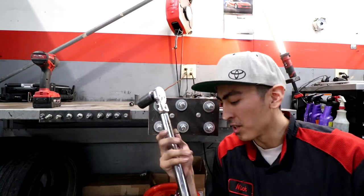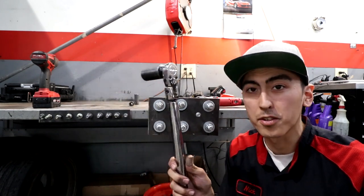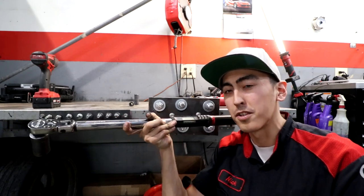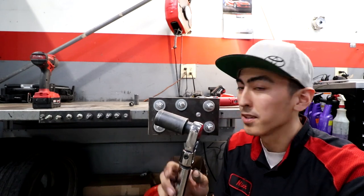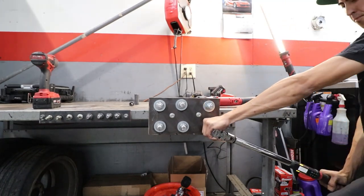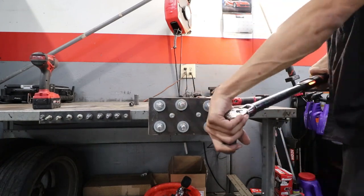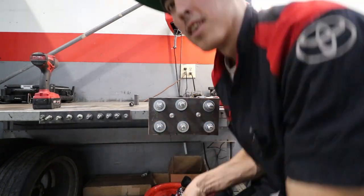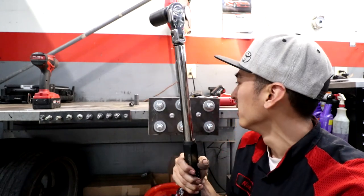All right, well, that's actually really impressive. I was able to take off 250 foot-pounds, like, no problem. So what I'm going to do is just crank the hell out of it. My torque wrench only goes up to, like, 275, I think, before it starts saying over-torque. So I'm going to hammer on it and see how tight we can get it, and then see if this gun's strong enough to take it off. We were able to get it to about 311 foot-pounds on the torque wrench before it said over-torqued. Let's see.